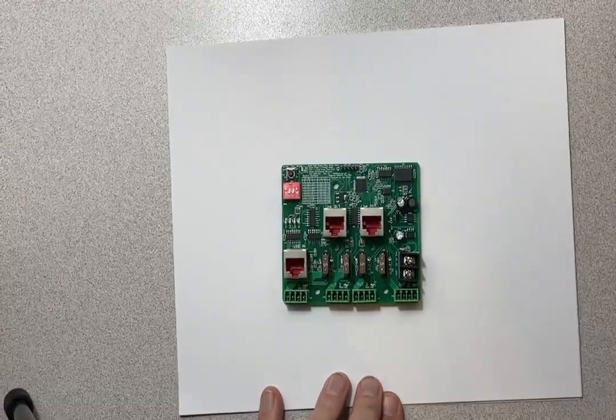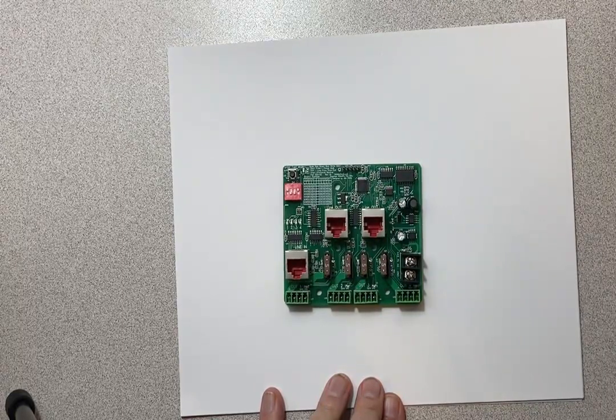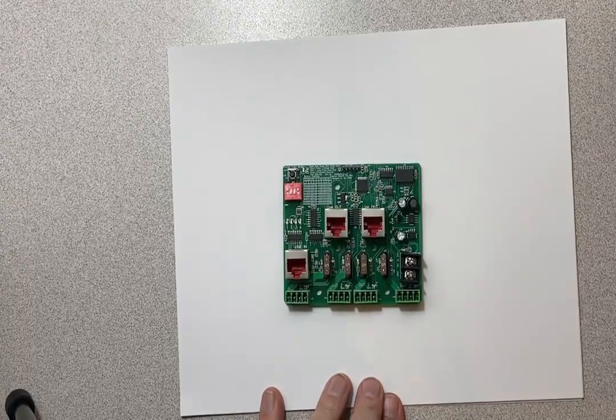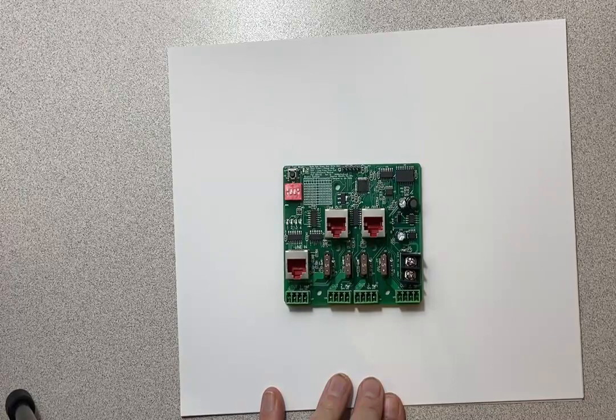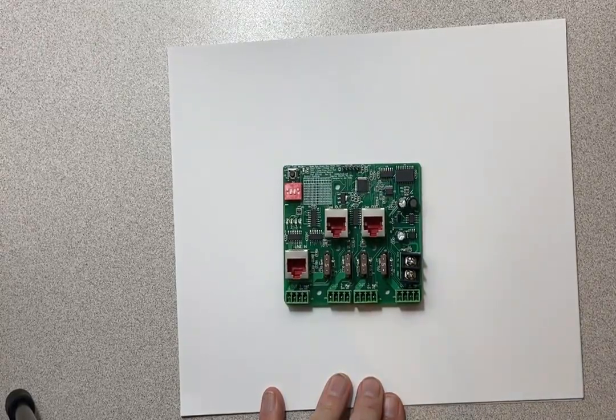The green LED allows you to immediately see what ports have been actively programmed in the HinksPix configuration page for long-range differential drivers. What that means is you have a board ID. I'll have another video on how to configure this within the HinksPix Pro web configuration page. But you have an ID that identifies how these pixels or how these ports are going to be driven. Now, not all of the ports need to be active. You could activate 1 or any number up until 3. When you activate a port, a green light turns on to validate for you that that board will actively pump data out that specific port.